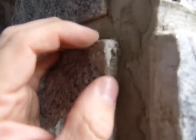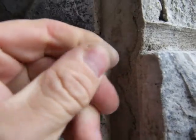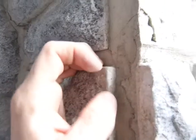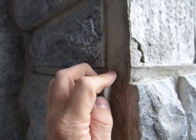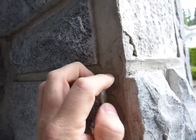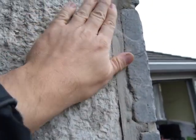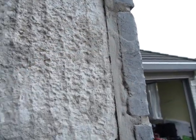I'm also noticing that in the small amounts where there is mortar, it's crumbling and dusting off, probably due to its content. There should be enough cement and lime in the mortar mix, but probably when this was mixed it was basically just wet sand with no cement content in it. Look at that — I can make it smoother just by rubbing it with my finger. That's not how mortar joints should look like.